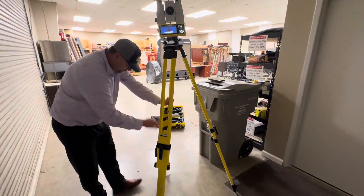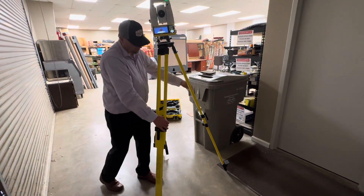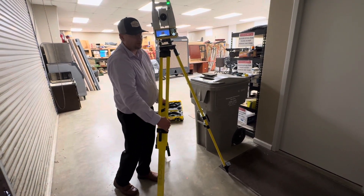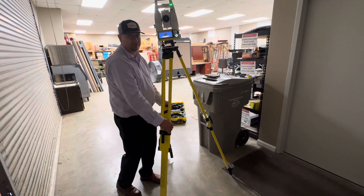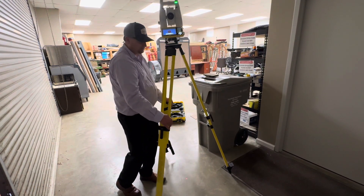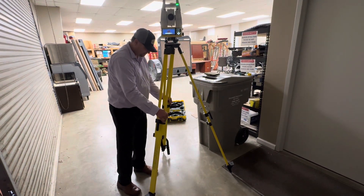Now, this is the key here. I have a point on the ground — point number one. I pick up with my two hands here, and I pivot on this leg here until that laser is dead center. This is probably the most critical part that people kind of start sliding around and don't know what they're doing. So I'm here to pivot. You see how it's easy? Get really, really nice and tight over the point.